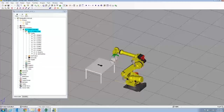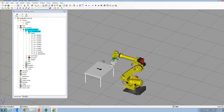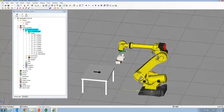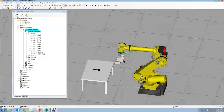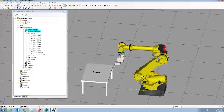Okay, we're going to drop into RoboGuide. Here's RoboGuide — we've got a simulated R2000iC. We have tooling that was used for a trade show many years ago for our famous bin picking connecting rod demo. It uses a pneumatically actuated parallel gripper, which we're not going to actuate in the simulation. It's got a little space for a 3DL. Here's our flat table with our connecting rod already on it. The first thing we're going to do is enable vision simulation.